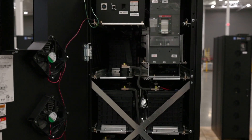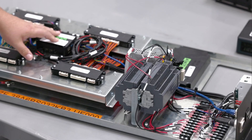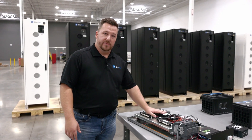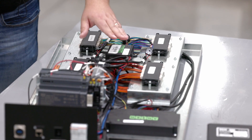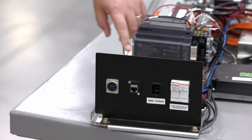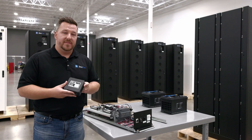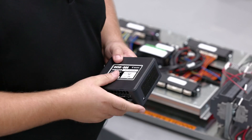Now let's dive a little deeper on the BMS and Tray 8. Tray 8 houses all of our BMS components. We collect all of the battery and system level data and bring it up to the top of the cabinet. This is easily accessible through the top for any service-related items. When all of the data comes up to our R3000, it is available via Modbus TCP through the front port. We also offer our system level data collection device called the BX50. This can connect to up to 50 battery cabinets and store all of that data for the life of the system.